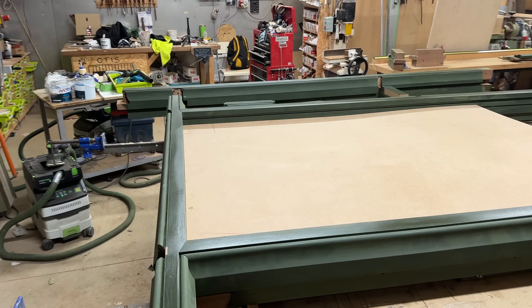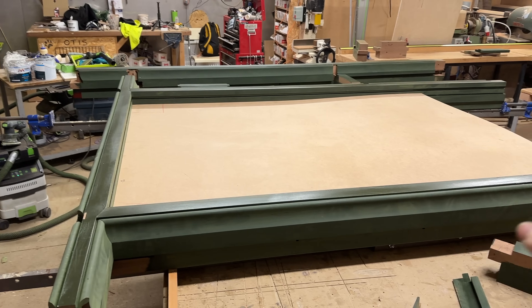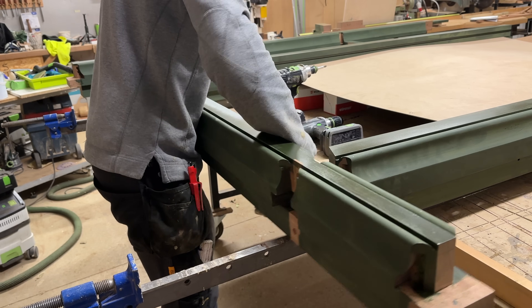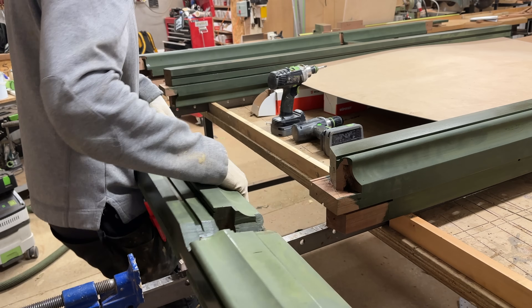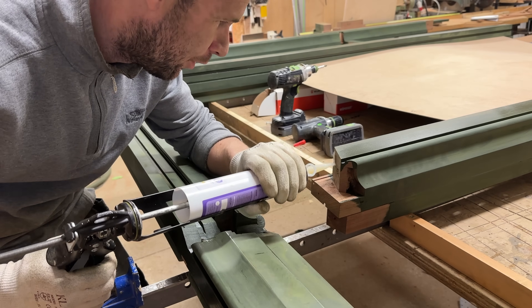I've cut a board to fit between the rebates — a tight fit on the width with a square end cut on my saw — and that's going to give me nice square door jambs versus the transom, just to square everything up because I haven't got loads of stuff to reference on. Of course we've got the legendary backing soundtrack of The Grinder.